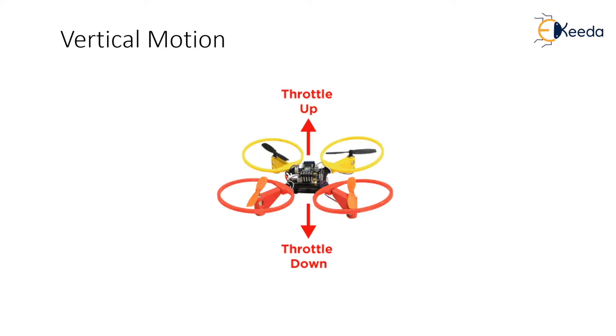Now a drone can do three things in the vertical plane. To hover, the net thrust of the four rotors pushing the drone up must be equal to the gravitational force pulling it down. So what about moving up, which pilots call climbing? Just increase the thrust of the four rotors so that there is a non-zero upward force greater than the weight. After that, you could decrease the thrust a little bit, but there are now three forces on the drone: weight, thrust, and air drag. So you will still need the thrusters to produce more than for just a hover. Descending requires doing the exact opposite — simply decrease the rotor thrust speed so the net force is downwards.